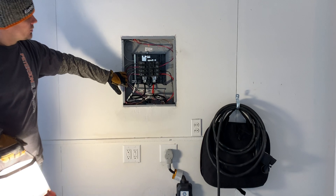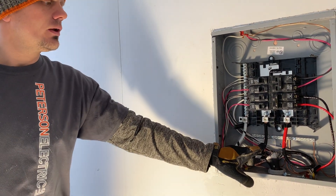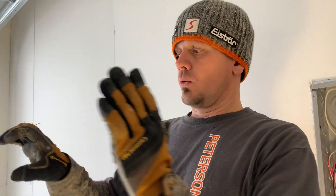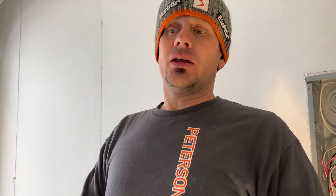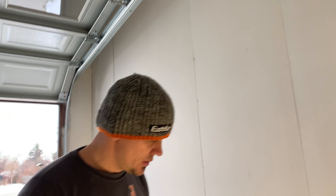So we set the sub-panel — it's rated up to 125 amps. Again, this wire could do 95 to 100 amp, but I only had an 80 amp breaker, which is all they need right now. He probably will do a wood shop in here, but I doubt he'll charge his car during the wood shop. The heater might be on with the car — that's why we did that. As you saw at the panel outside, we did 100 amp to that basement. I don't like coming off that panel if I have extra spots in the main panel. Later, they want to see if they can get a directional bore — an 8-inch hole — and go out to the other corner of the driveway to upgrade and get 200 amps. We've got to call the engineer, Fort Collins Power, and see if they'll let us do that. Anyway, here's how that works — I labeled everything.